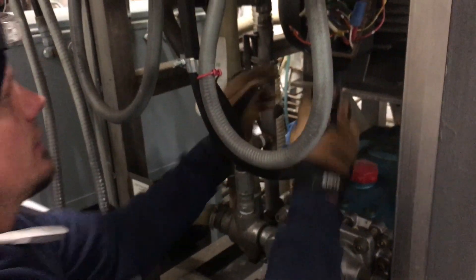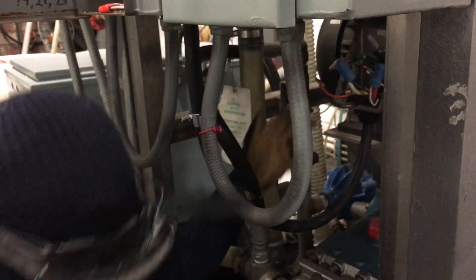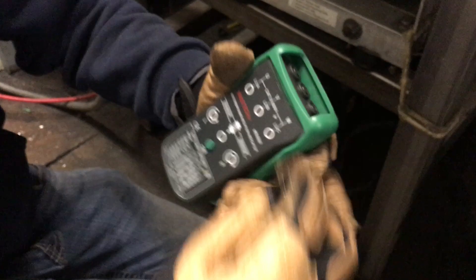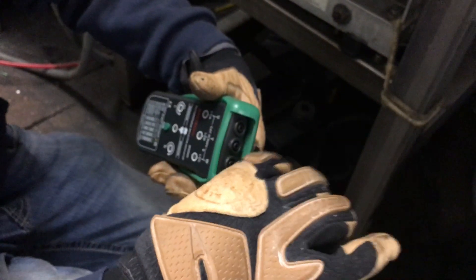I did bump start it. There is a trick to the disconnect — I want to show you that. I was checking the phase rotation, and you can do that down below here. I have a meter that's a phase rotator. The battery just died, so I'm going to do that. But it basically states that there's an L1, L2, and L3, and you're going to line those up correctly — going L1, L2, L3, left to right.